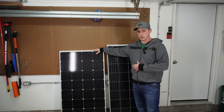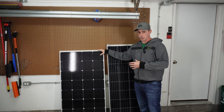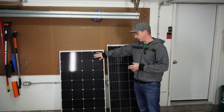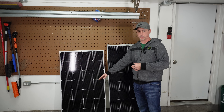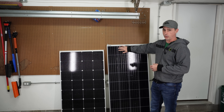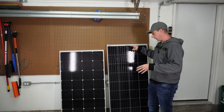As you can tell, 200 watts versus 180 watts. This panel is going to be a lot more ideal for shaded or cloudy conditions because if you shade one of these cells the rest of the panel is still going to produce power. Whereas this style here, as soon as you shade one little bit it's just going to knock it right out and you're not going to get the series connection.